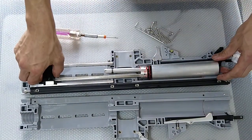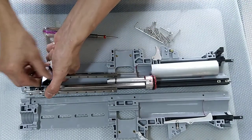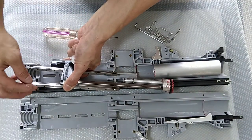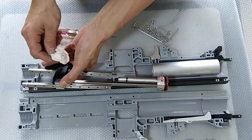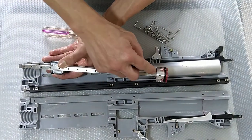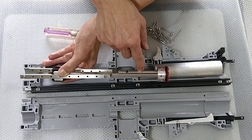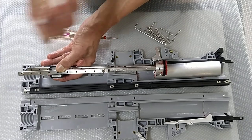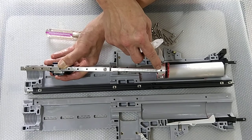Slowly remove the rail — it's important that you slowly remove it because if you are not careful the rail will come off from the rail block and you will have a lot of ball bearings dropped everywhere, which is not what you want. There's actually an Allen key screw here — this will tighten your pusher or ramrod to this steel bar. Sometimes after you play a few times this may come loose, so just use an Allen key to tighten this grub screw.